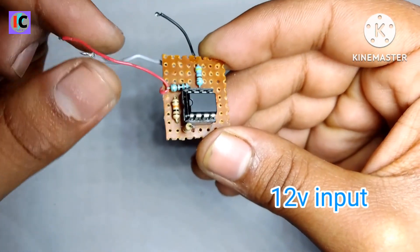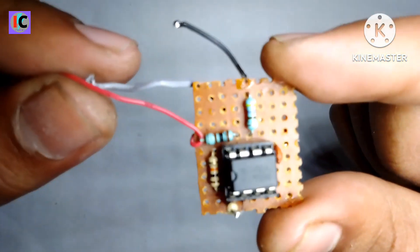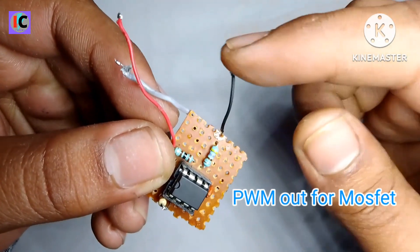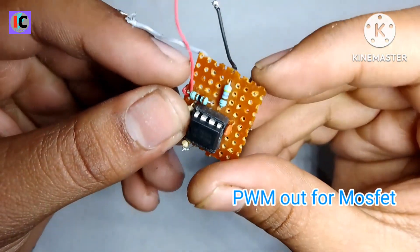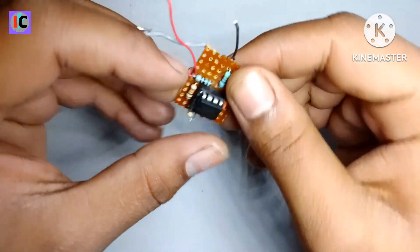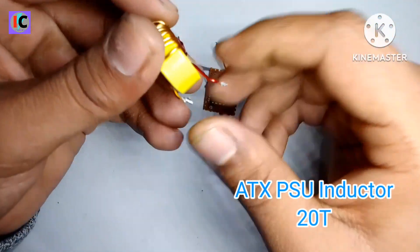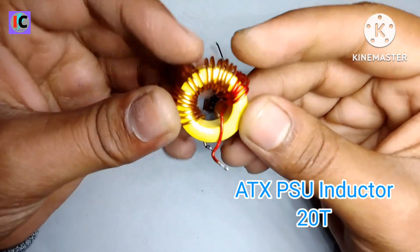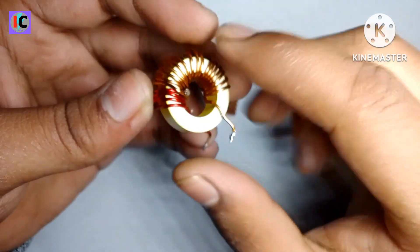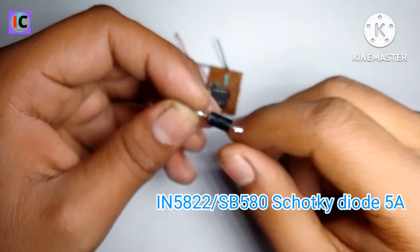This is the circuit I made on a circuit board. I use the red and gray bar for the input and the black is for the MOSFET driving gate. This is the back side, and a huge ATX power supply inductor of 20 turns — this wire is almost 1.5mm.